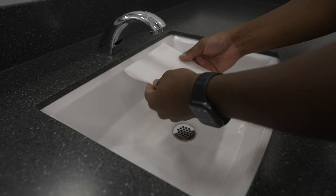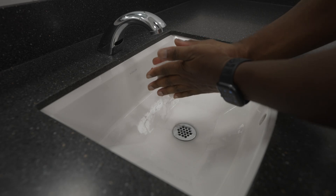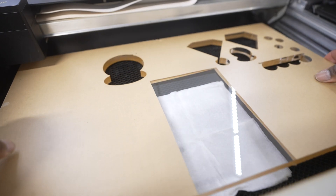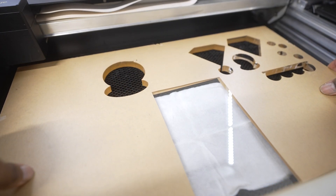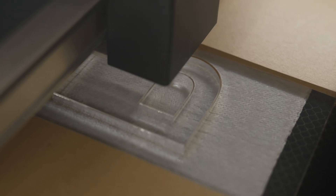You want to get your paper towel. Make sure that you have at least four layers of paper towel, and you want to run it through the water — but you don't want it dripping. Pat it a little bit to make sure it's nice and down. Then lay the paper towel down on your laser bed and put your acrylic right on top of where you're going to be cutting it. The moisture from the paper towel, when you're cutting, it just absorbs it, and it makes the cut way cleaner, especially when you're cutting really thick acrylic.